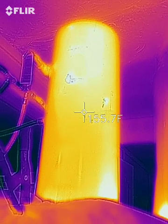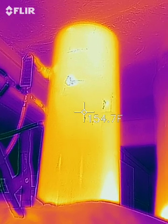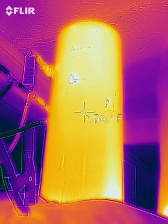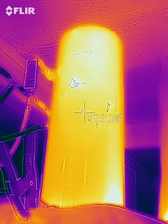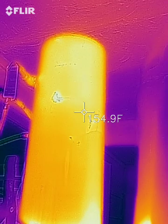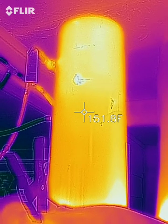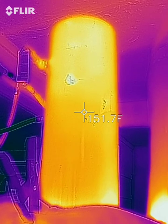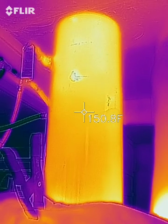It's a standard 8-inch rocket mass heater that heats my barn. This has an electric on-demand digital electric water heater that at 40 amps uses a lot of electricity and barely provides enough water for a tepid shower in the winter, because the groundwater temperature is about 45 degrees when it gets into the barn. So the idea here is to have a pre-warmer, a tempering tank, but we just happen to have it sitting on top of the rocket heater.